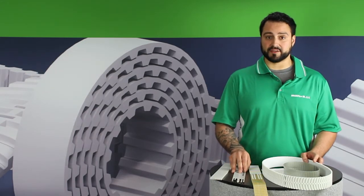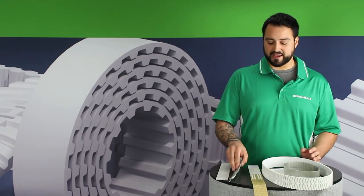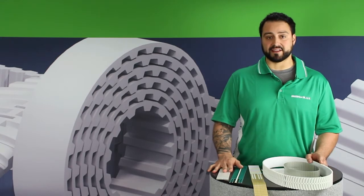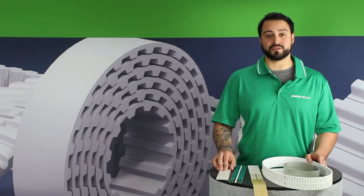Being that it is a welded belt, it will have roughly 50% of the tensile strength of our truly endless belts. And these can be produced in virtually any length in one-tooth increments, starting at a minimum specified joined length that you'll find in the B212 catalog.